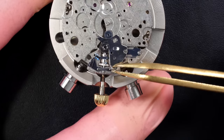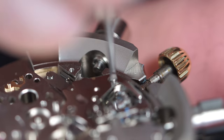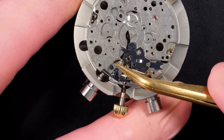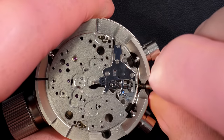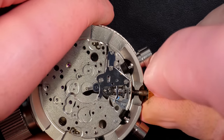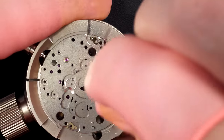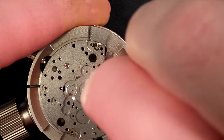I'm putting this part in - I didn't fully screw this screw yet, screwing the second one first. Now putting some heavy blue grease there - it's a high viscosity grease because this part will see a lot of tension and strength between them. That's why you put this grease to make sure the parts don't wear and move between each other nicely. Just removing the excess grease.